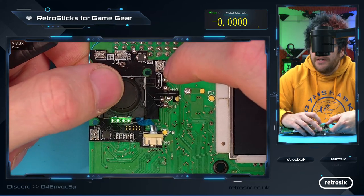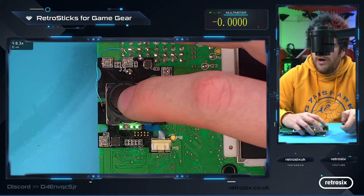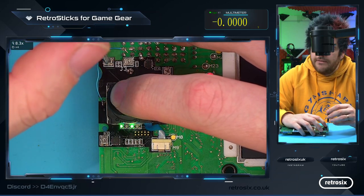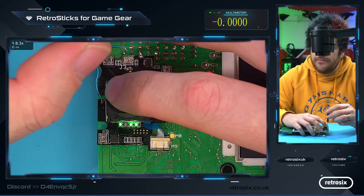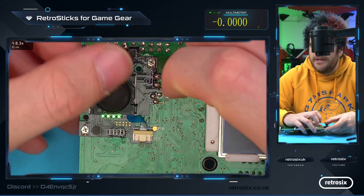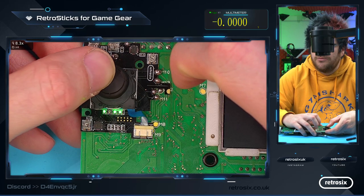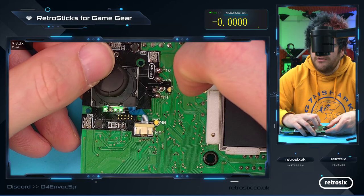And you can see that up goes off, but the left doesn't quite go off when it's in the top corner. So while I hold it in the top diagonal corner, I'll really, really slowly turn this potentiometer so that it goes off. There we go. And that's now got a diagonal press. So there's your diagonal. So as you're rolling, left only, ups involved, only ups involved. And this is based on the roll.